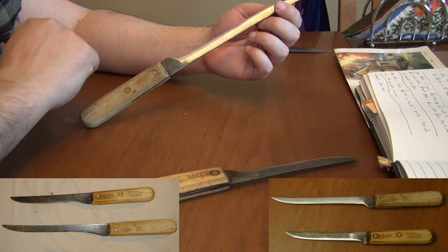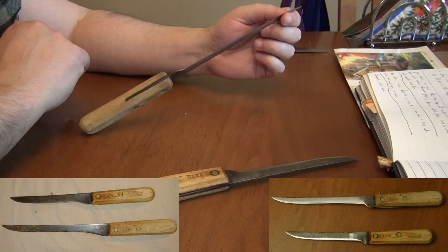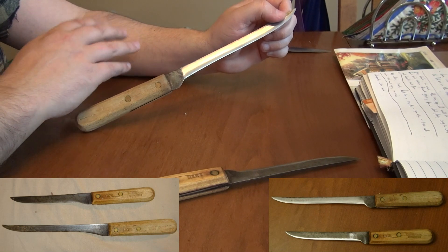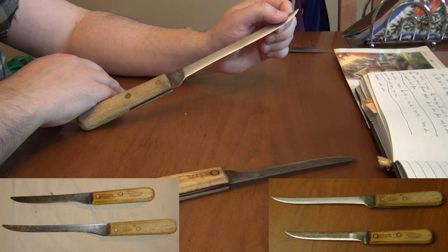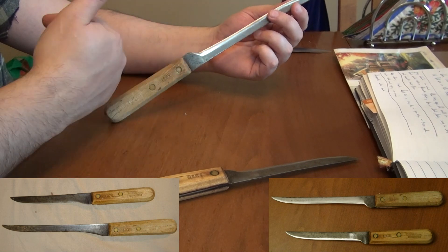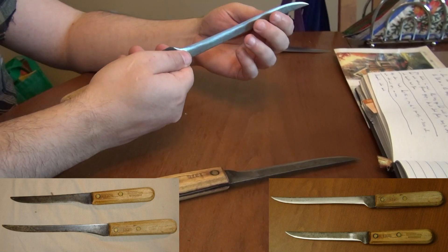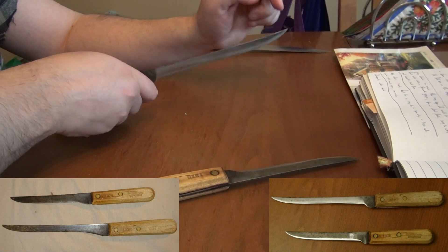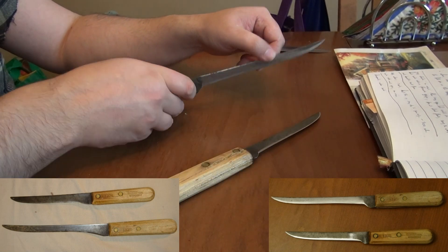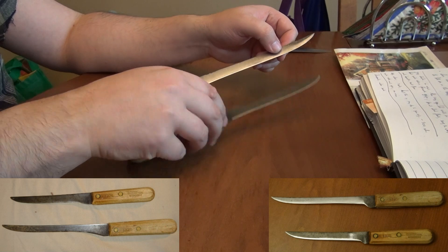What I had to do was flatten the whole grind out, and of course the only way to do that is you end up taking the natural patina off. But I thinned the blade back to produce a decent level of thickness at the edge so it can cut well and be easy to sharpen - unfortunately sacrificing a patina that was at least five generations old. Without doing that the knife simply wouldn't cut very well. I left this exaggerated guard here again - if it was my knife I'd take this all the way back and cut that big chunk of steel off, but you don't know if the person is used to using the knife with pinch grips in this area, and if you have that area blazingly sharp they'll cut their fingers. Restored with a very fine point - now you've got a relatively heavy utility knife and a relatively stiff but workable fillet knife or light vegetable peeling knife. Currently on five generations, very shortly going on six.